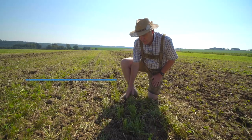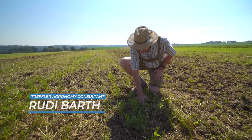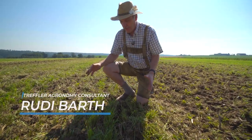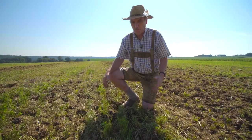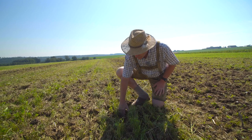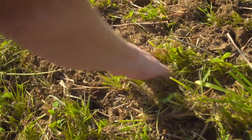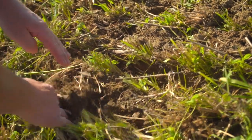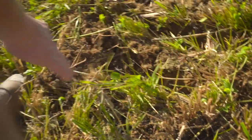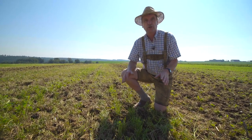We've gone here with the spring-tooth cultivator, and as you can see, we only make cracks and gullies in the soil. This is useful when we subsequently work with the cultivator. No large pieces of sod or turf are thrown out, which cannot be worked afterwards. We're just making a slit in the ground. You can see that here and there — the grass clover actually remains. During the next step with the cultivator, everything breaks up nicely into small pieces.